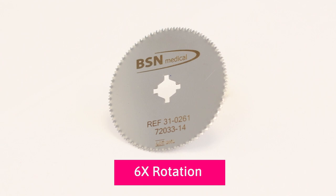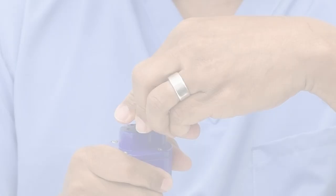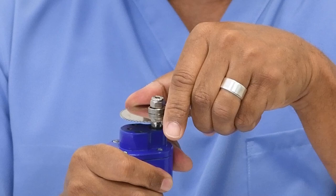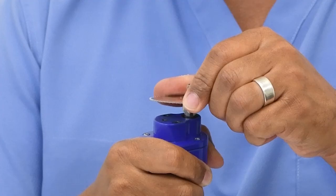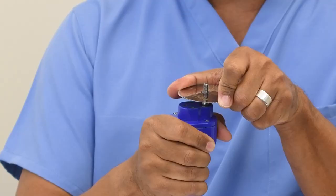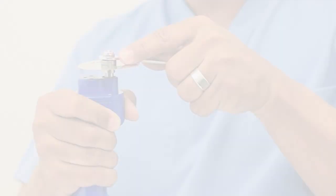You will first loosen the nut on the saw shaft. The nut will be loosened using the small side of the hex wrench provided. You can remove the nut and spacer completely if this helps visually, or you can loosen the nut just enough to allow you to move the blade off the hex portion of the shaft to rotate it to the next position on the blade. For the hex cast saw, rotate the blade 60 degrees to the next open position, applying a downward pressure until you hear a click as the blade sits properly on the hex shape of the shaft. Using the hex wrench, tighten the nut down onto the spacer on the shaft as far as you can tighten.